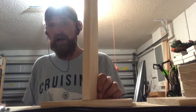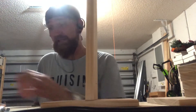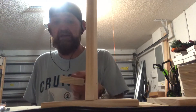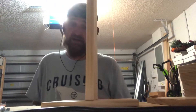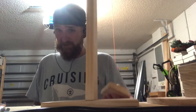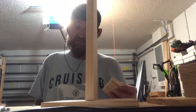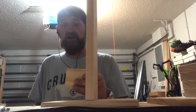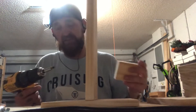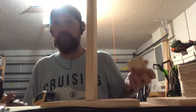If you don't drill the pilot hole, there's a good chance the wood may crack at some point. You can also use wood glue to glue these on, but I prefer using a screw because I'm gonna have some heavy watches on these little watch arms. I like to use the screws to make sure it stays in place — or you could use both screw and wood glue if it makes you feel better.